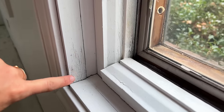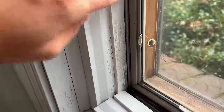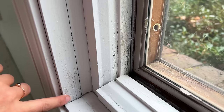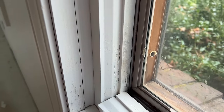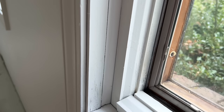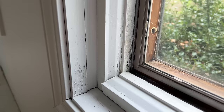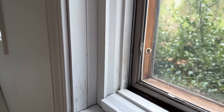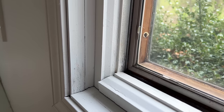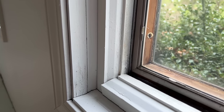So this is what a tannin looks like coming through. See this kind of yellow? And it cracks. So that's what happens when you use latex paint over natural wood or anything that is stained. It's not going to cover it very well. Even if you did 100 coats of latex paint, it still could come through. So that is why using Kilz is important. It'll cover that right up.